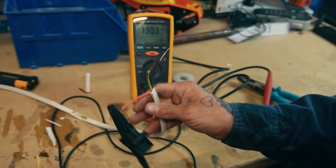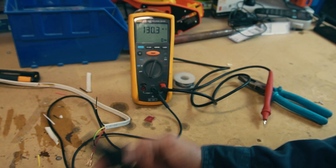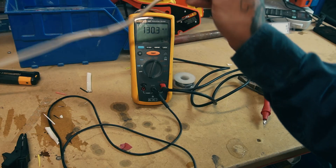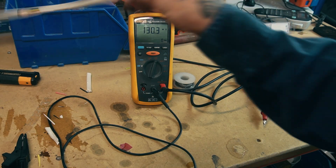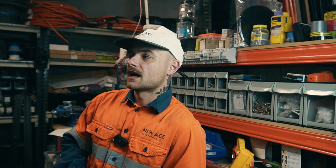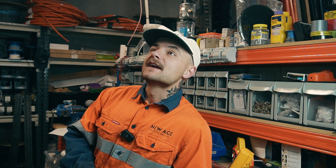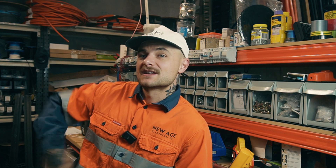After a few hours that'll probably dry out — by the time you get to the fault you'll put your tester on the end, test it, and it's going to be fine. You're not going to be able to find that fault until the water comes back. Like I said, e-fix did replicate this exact test and that's where I got the idea — but I wanted to put it into perspective for Australians to see faults you don't think of when someone calls and says their circuit is tripping, then you get there and it's not.